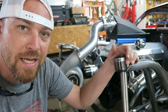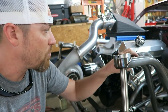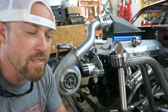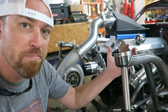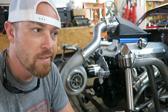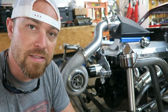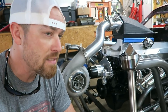And with jacking the camber, I'm sure there'd be some more load issues in cornering. So I just wanted to tie these in somewhere for a little added strength. And I don't think the cylinder heads themselves would take that much load. If they did, it would actually be pushing versus pulling. Think about a lot of things that are attached to your cylinder heads, a blower for instance. Those stresses don't seem to affect the cylinder head moving or causing gasket issues, anything like that.